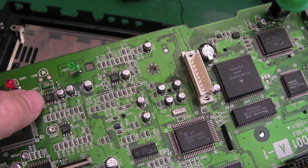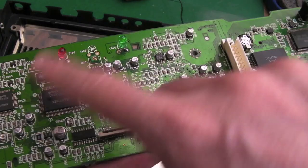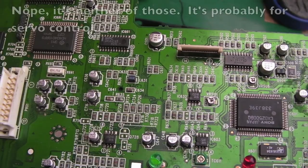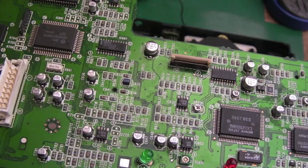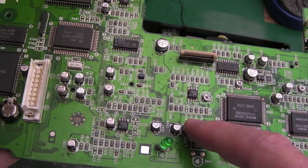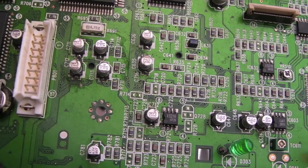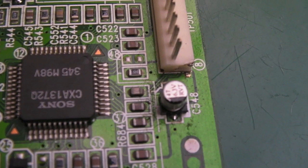But you see here — just the odd spot where some stuff has leaked through. That's the BTL driver there for the CD unit. There's a JDC chip here — could be a DAC or something. There are a number of op-amps and things on here. When we talk about the problem with the audio, this is primarily where you want to be looking — around the CD section here. The electrolyte that's still on here is horrendous — it's pretty bad. I'll get you a close-up on macro in a minute, showing before and after as I clean up.